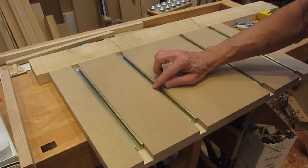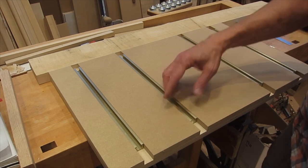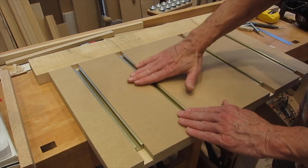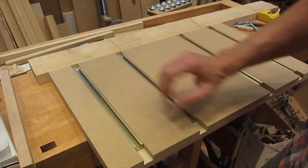This MDF material is just a couple of thousandths of an inch higher than the track, which is okay. If it was the other way around — if the material sat lower — that'd be a problem because then you'd be rocking on the track. In that case, I'd slip a piece of paper between the MDF and the base before screwing it down.